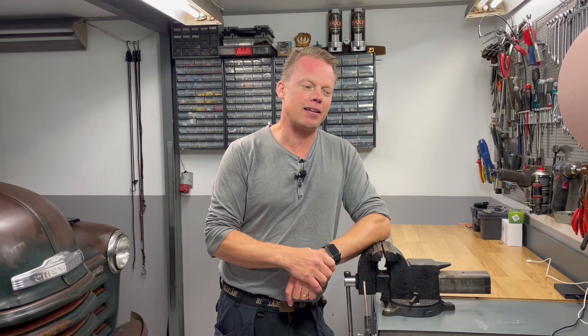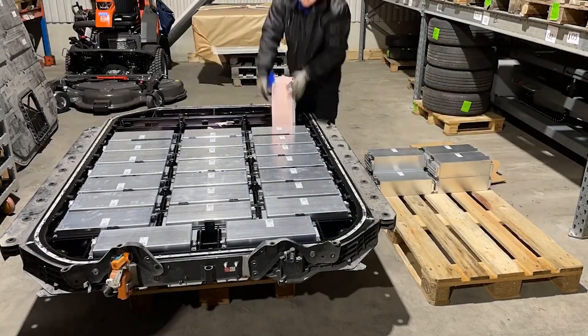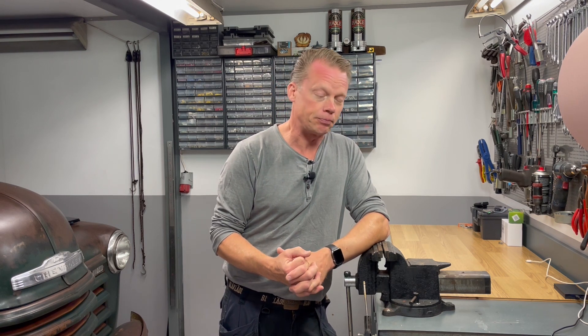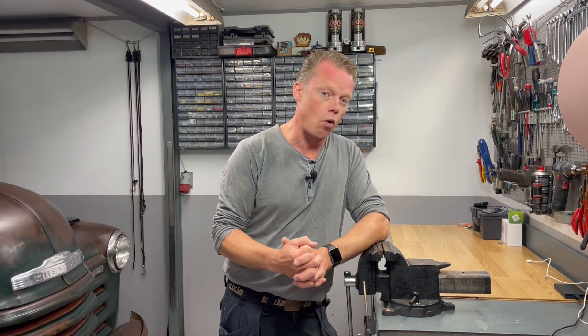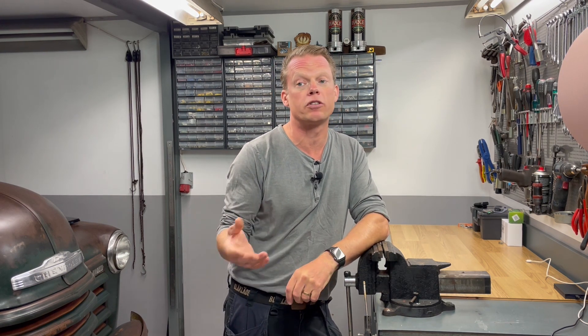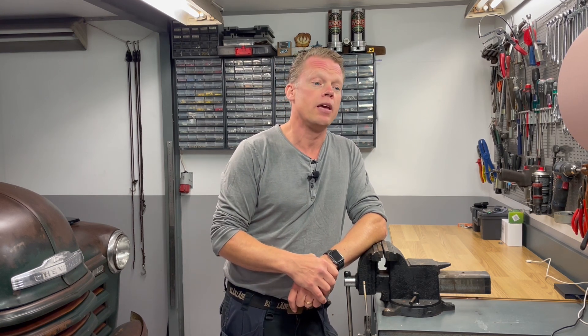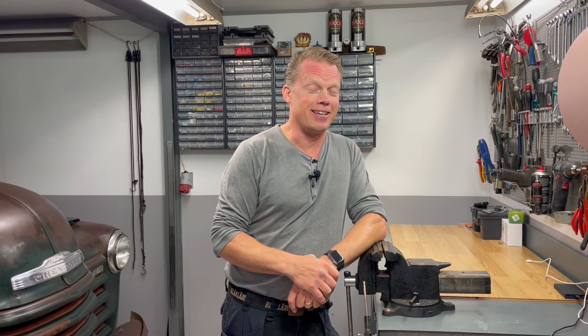So I have a plan to build a 36S battery pack for my CityStromer. Last summer I ripped modules out from an Audi e-tron battery pack of 95 kilowatt hours, and I am planning to use 12 of those battery modules. Each module is built up in a 3S configuration, holding 2.65 kilowatt hours each, so that will be around 32 kilowatt hours. With used cells, I expect at least 25 kilowatt hours usable in the end — much better than today.